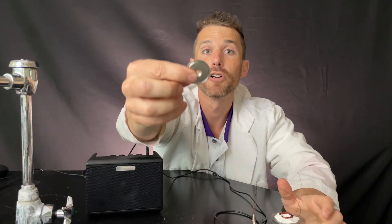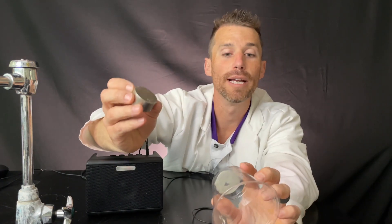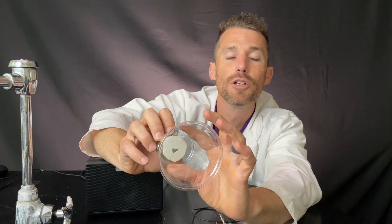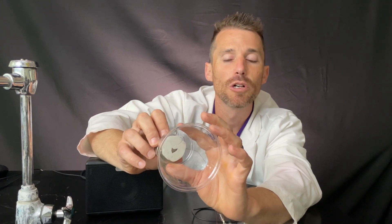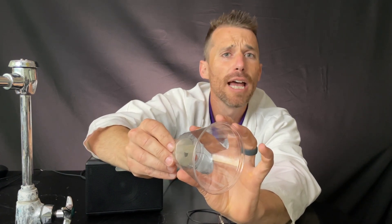Let's try a bigger magnet. Here's one of our circle magnets. Works pretty good — I can feel it moving in my hand. Sound is made by vibrations, and the coil is moving because the electric current moving through it interacts with the magnetic field and feels a force. Let's try our big 40 by 20 magnet. Doesn't sound too much louder than the other one, but certainly louder than the small one. That's really cool. Okay, let's do a quick comparison — big magnet versus one with the ring. About the same. Interesting.